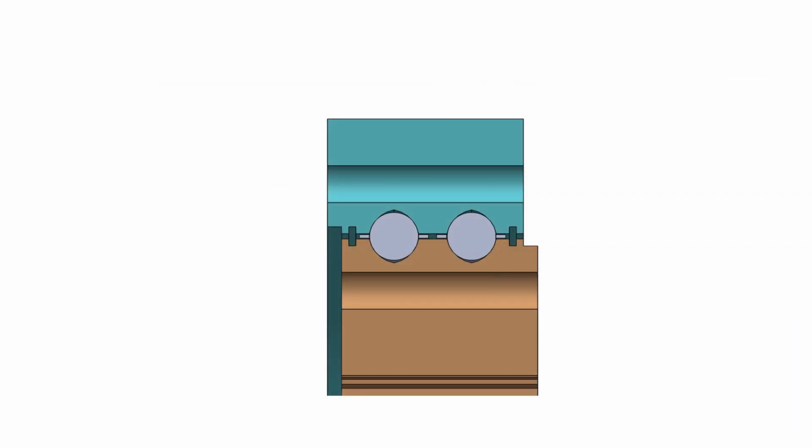The bearing is lubricated with grease due to the low speeds, and because grease is better for keeping out foreign matter, which is a problem since this bearing will be exposed to rain, sun, and dust. In addition, newer H-shaped seals are also UV-resistant polyurethane to cope with the sun.